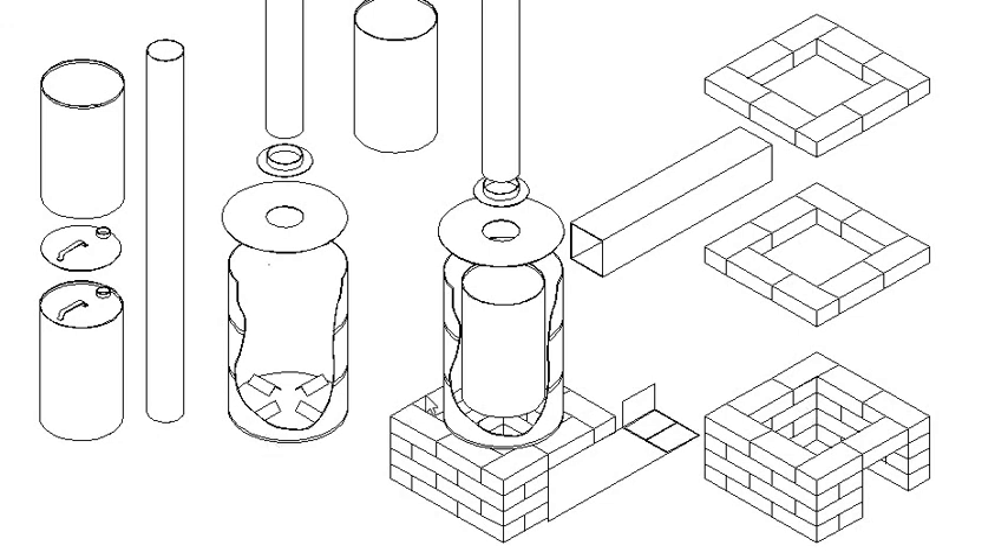Having this below ground level insulates it because you've got lots of thermal mass around it and it's not subject to wind, so it's not going to be cooling down. Once that fire is going you could quite easily take that oil drum away — it might be an idea to bolt some handles on it just to make it easy to manhandle. With the inner drum, where you've taken that lid off, drill a couple of holes through it — maybe three or four in the sides — so you can get a piece of wire through, or just a nut and bolt so you can flip it over without worrying about the timber falling out. This one would be sitting on those bars, and if it drops out it's only going to fall about 40mm, but with this big stove underneath it needs to be retained.